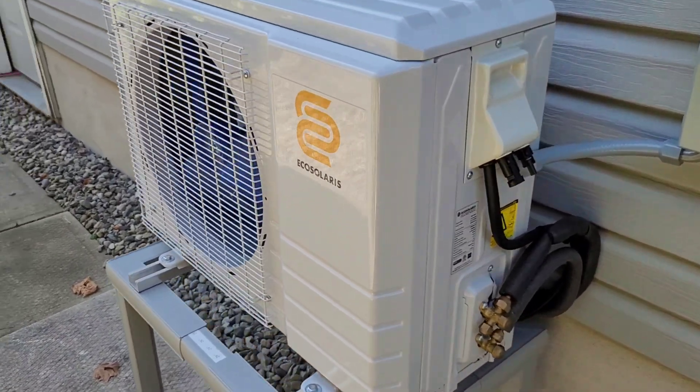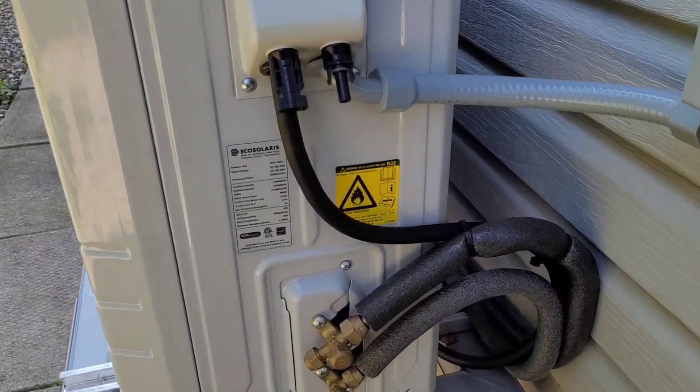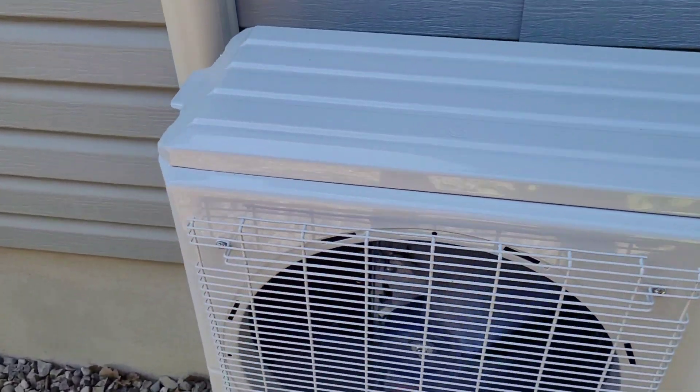It's 11 AM the next day. The unit just kicked back on for the first time since about 11 PM last night — we did really well overnight. We're sitting at 64% state of charge and the garage is just now getting up to 73 degrees on the Nest. The EG4 would have been running at around 200 to 250 watts overnight, but this one was pretty much off all night. I also want to show how quiet this thing is — running at around 300 to 400 watts it's super quiet, especially compared to my neighbor's AC.